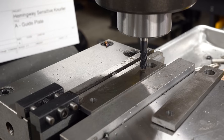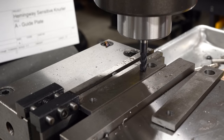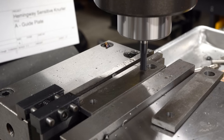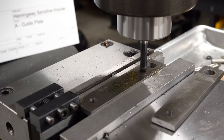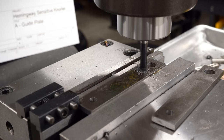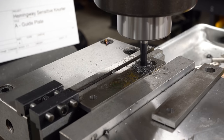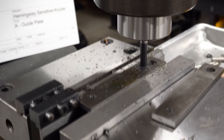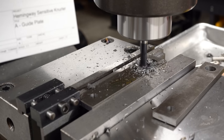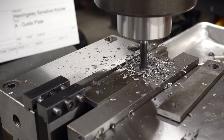The last feature we need in the guide plates is a quarter inch slot, which I'm cutting with a quarter inch carbide four-flute center-cutting end mill. I'll touch off with the quill, zero the DRO, lower the knee a little bit, then raise the knee to plunge the cutter to the desired depth. I'm taking this nice and slow - wasn't sure how it was going to behave in this material with a four-flute end mill, but it just went in nice and easy without complaint.